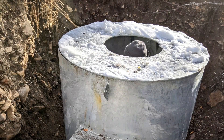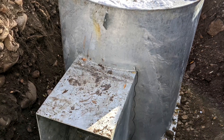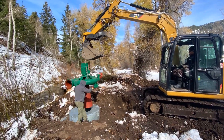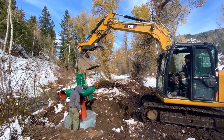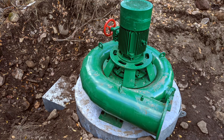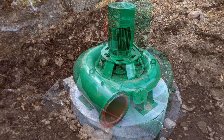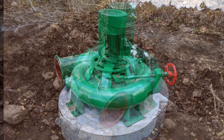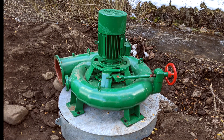A metal discharge chamber, which has been prefabricated off site, is positioned to discharge the water back to the stream bed. The Francis turbine with an extended draft tube is installed and bolted into this chamber. In a future video, we will discuss more about how this design functions to extract power from water and when it is the best choice for a micro-hydro system.